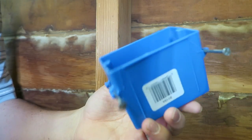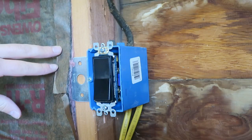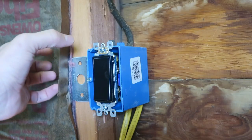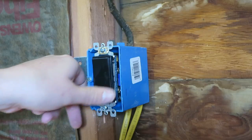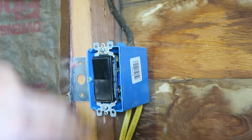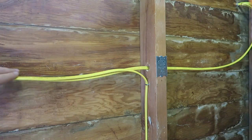I'm not going to hammer this one in because I'm using a different style on this wall. Here's a look at one of these different style boxes installed. They actually kind of grab onto the other side of the stud and wrap around, and then you've got two nail holes you can put here, plus a nail hole up top and a nail hole on bottom. Here's a look at that upper nail hole.